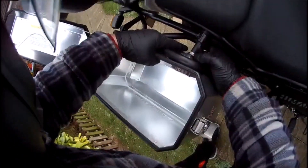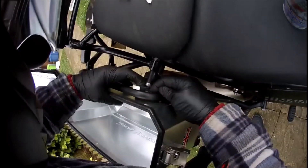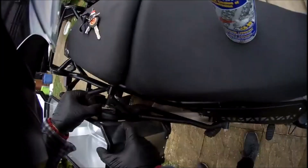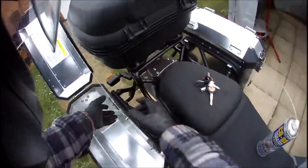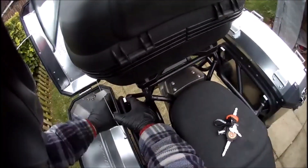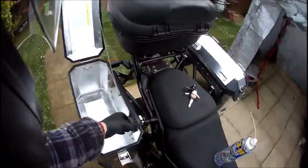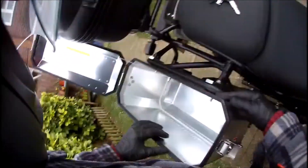You line your bar up with the groove in there, like so, then spin it up till it bites - and then probably another half a turn. That's all you need. Seriously, you do not need great armfuls. Spin that up a bit - like so. That's it. You don't need to give it beans. This is plastic with a brass insert with a thread on it - that's going to pull out in no time.